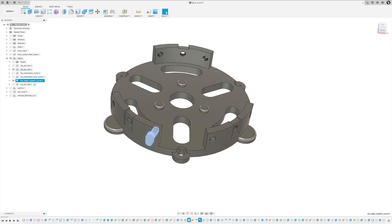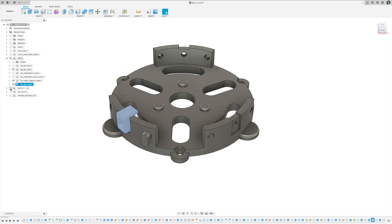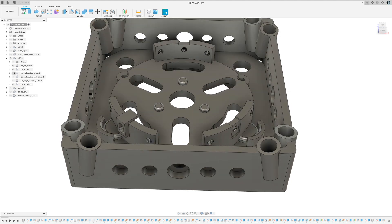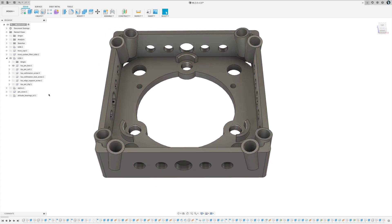The top section will have a screw as well, plus a clip to hold the mirror in place — the mirror will sit on top of that. That's the primary mirror cell. It's going to sit in a mirror box, which I printed all as one piece thanks to the large-format printer. It measures 240 millimeters from edge to edge — about nine and a half inches — which fits really nicely and is about the max for my printer.